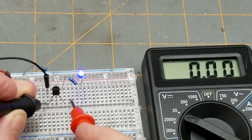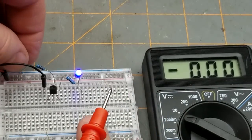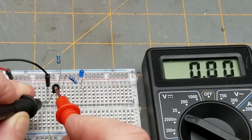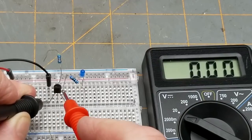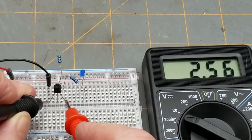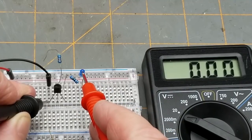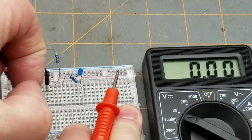Okay, let's turn it off. There's essentially only 2.6 volts across this right now — that's an open circuit. The collector-emitter is an open circuit; there's no base voltage because it's open. So the voltage at the collector is 2.6 volts, and where that's coming from is the fixed voltage drop across the LED — there's always going to be a fixed voltage drop across an LED.